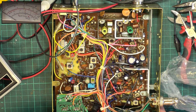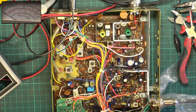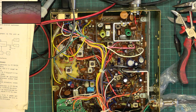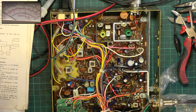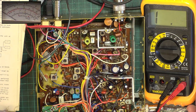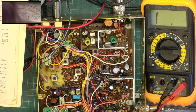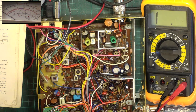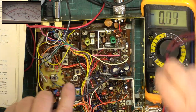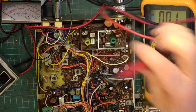Right, having made the fibre washers in the organ workshop, which are now on the radio, I suppose we ought to check the VCO, because you just don't know. Although it looks immaculate, you just don't know. So on this radio, we turn our attentions to channel 40. So that's channel 40 selected. I expect it's a floating chassis, so I better put that on power supply negative. There we go.